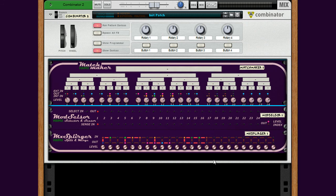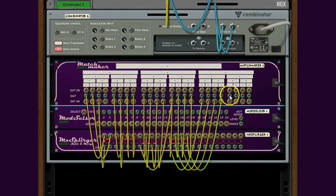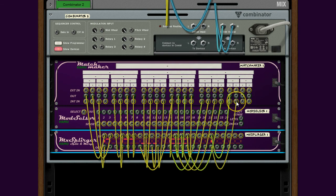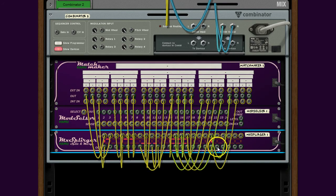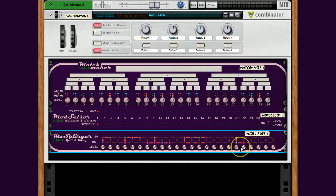The level adjustment goes from minus two to plus two, so it's quite possible to invert a signal. However, you cannot invert a signal when you only have one input and one output, because the knob will affect both the input and the output. If you turn the knob to the negative side, you will invert both the input and the output and again you will get a positive output. In this case you need to use two outputs from the same input, then you can turn the additional output to an inverted level.